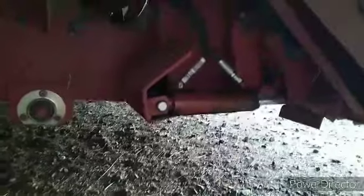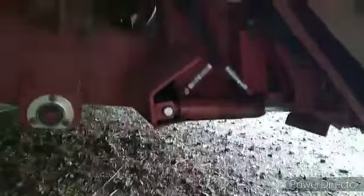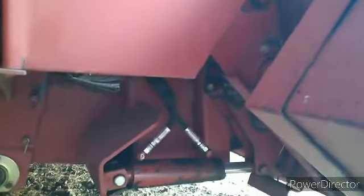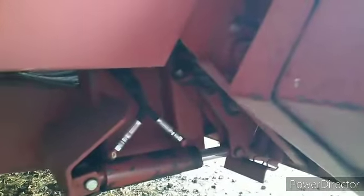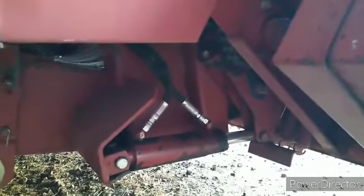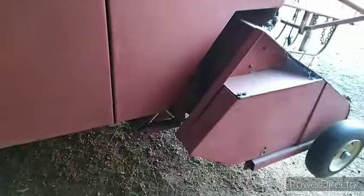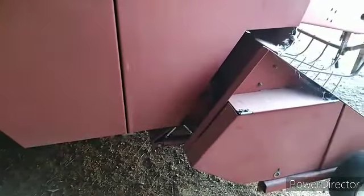What I'm talking about is the lift cylinder. See how this one is — it's a straight push, parallel to the ground. The hinge point is still up here, but you're pushing straight out, and actually the hinge point is almost straight above the cylinder. So this cylinder should literally last forever because of that advantage. The cylinder is short — it really only has about a four-inch stroke, and the other one's supposed to be six and a half inches according to the parts book online.